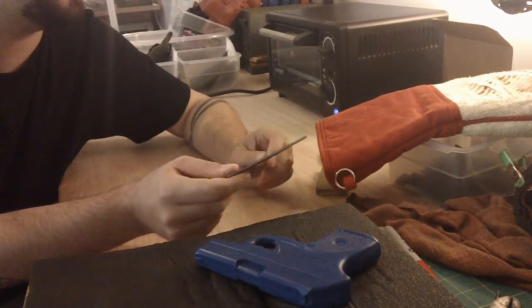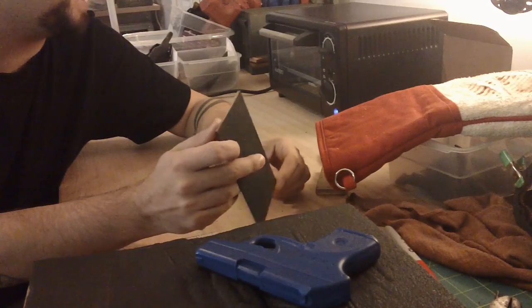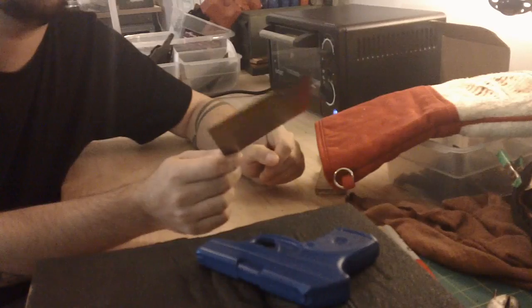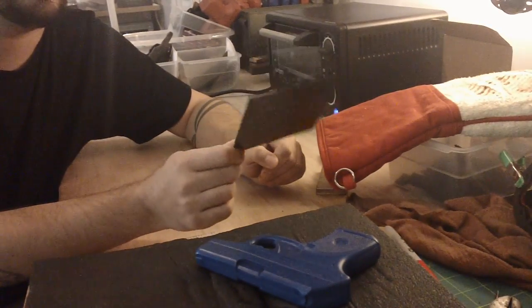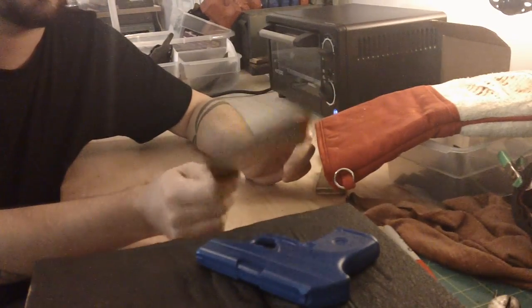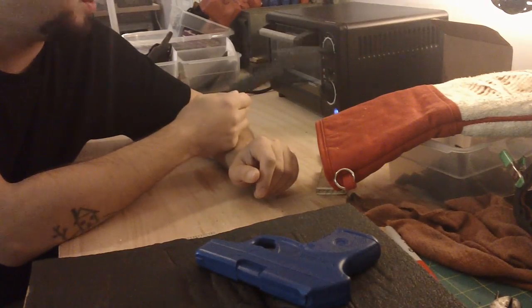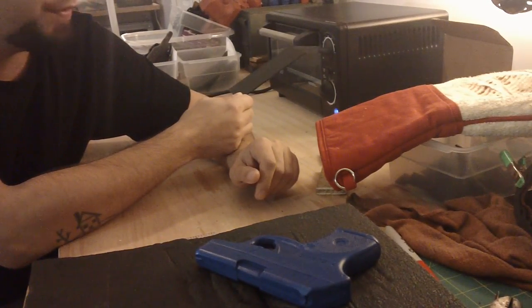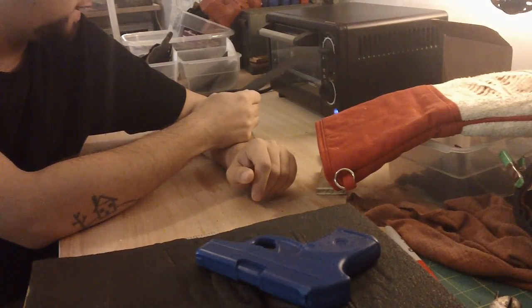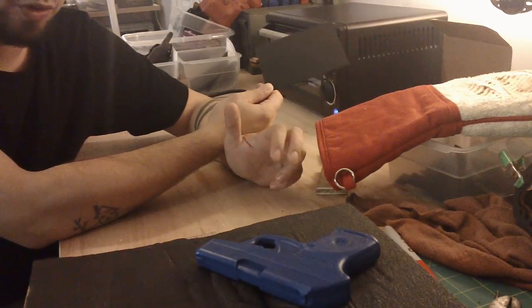The first thing we're going to do is not set the oven to our desired temperature right off the bat. It's currently set as low as it'll go. So I'm going to put this piece of Kydex in the oven at the absolute lowest temperature this oven can set to, and then, while I'm monitoring and slowly increasing the temperature, we're going to go from about 150 degrees to about 250 degrees on this dial. I don't know exactly what the true internal temperature of this oven is, but we're just going to go from 150 to 250 on the dial.